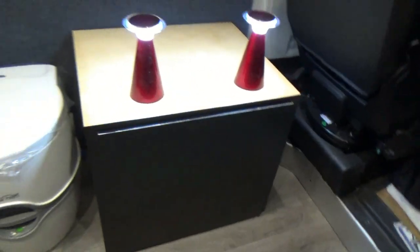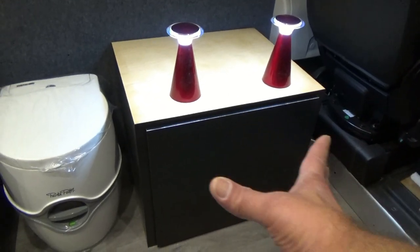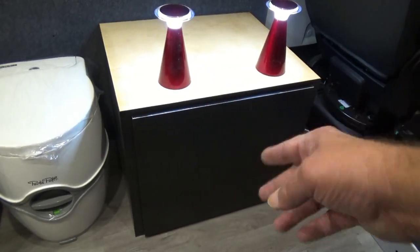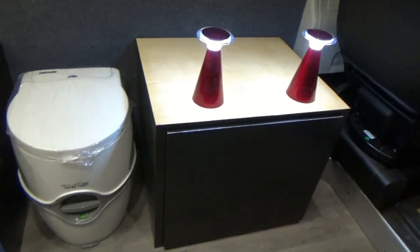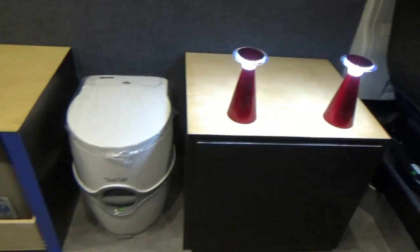I'm gonna take this door off. We're gonna put some glue around and add some more screws. That way it's nice and solid, and then we can put on our catches and our handle, and we can call that one done. I do have to go around and clean up all the edges on everything here, because I didn't do that yet.